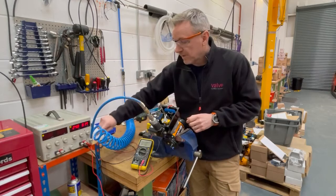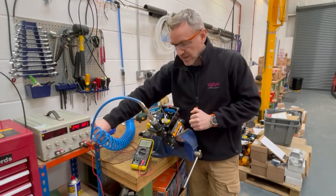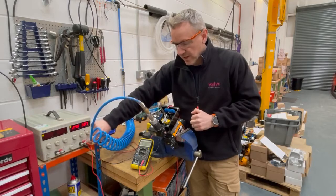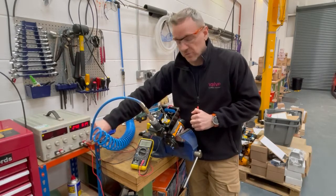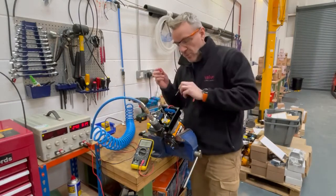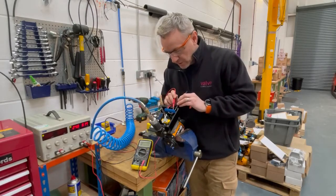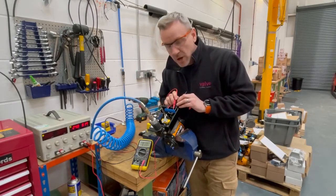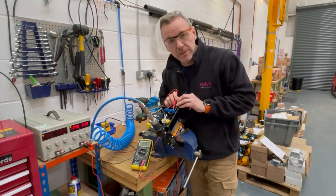We'll energize and you'll see that the actuator moved. De-energize and the actuator goes back to the closed position. In here we've set the top switch for closed. I've got the multimeter — you can see we've got a one there. We go on and I can see that switch is made because we've got the audible sound and the one disappears off the multimeter.